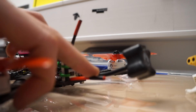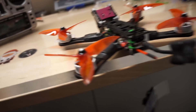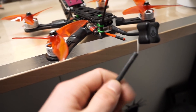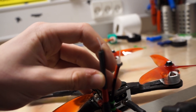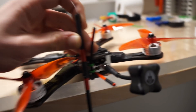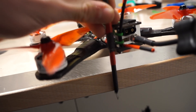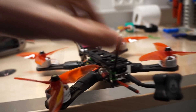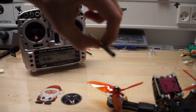That black part doesn't really act like an antenna, so I put it right here. HeTrapi actually said in the FPV livestream that mounting the polarized part of the antenna here would be best, and the antennas should be 180 degrees or in a straight line. The best possible spot would be like this, but you'd have trouble landing. He's saying you get a little better signal with a straight line instead of doing a 90-degree mount, but it still works. It's actually a bad idea to mount it like this because then you have a dead spot right there when you turn around.